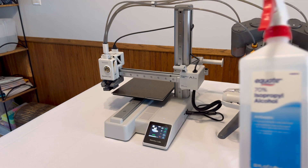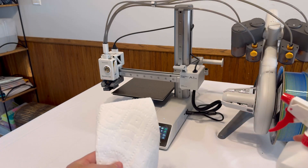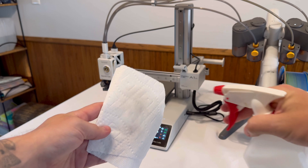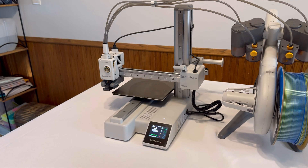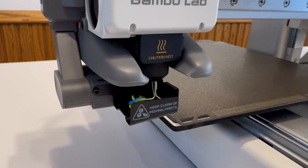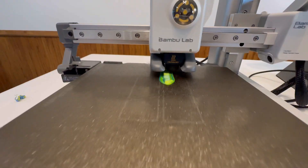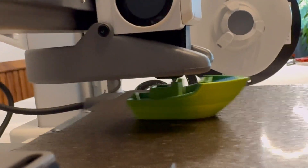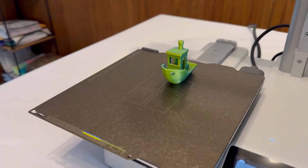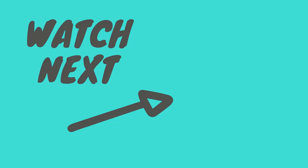A quick tip: clean the plate with isopropyl alcohol. Spray it onto a paper towel and clean the build plate between all your 3D prints. It's probably not a huge deal on your first couple of prints, but as you get going, oils from your skin get on that build plate and it can affect your prints. If you take a closer look at your nozzle, you'll see it is purging filament — that is perfectly normal between each individual 3D print. Chances are you'll want to print things from your cell phone or computer; if you need help setting that up, consider checking out the next video.